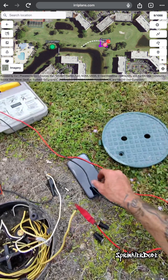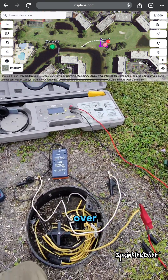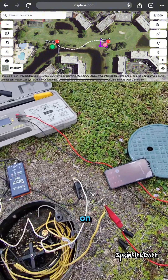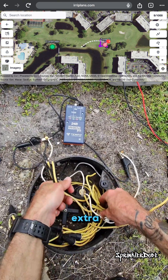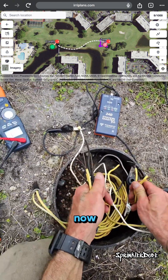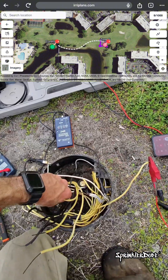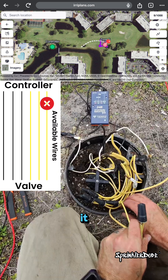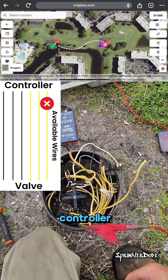With our tracker on... Hey Chris, I gave David that low voltage pen. I'm sending voltage over to the controller. I'm sending the voltage back with the tracker on what we believe is the zone 5 wire. Chris is now going to go check — there's an extra bundle of wires at the controller, probably shouldn't be extra, but he's going to see if it's one of those. There's a voltage reading on one but it seems like a false reading — not a wire. It can stay on. I have the voltage pen on one of the extra wires in the controller. Beautiful.